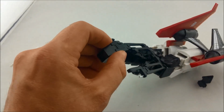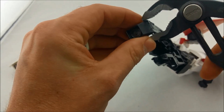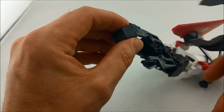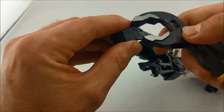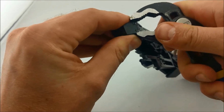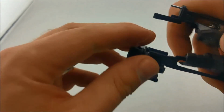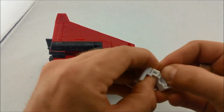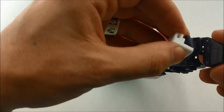Once you push the pin in, it's going to go in very easy because it's already been slotted there. Take your plier and finish pushing it in. You can adjust it out a little more to get it back flush. And you can see no damage to either side. Everything's clean. We're going to go back in and put the shoulder back in place.